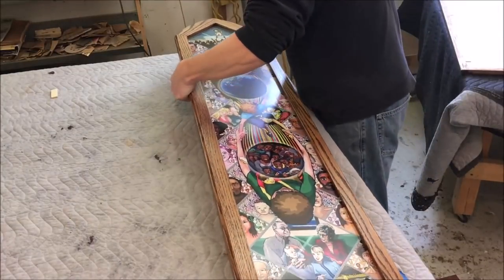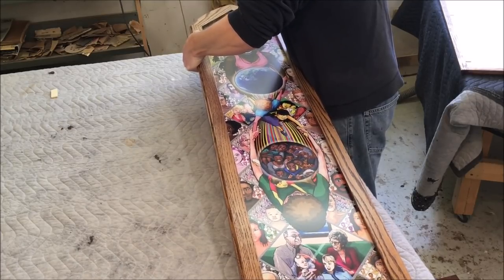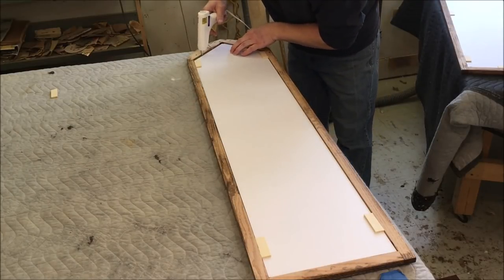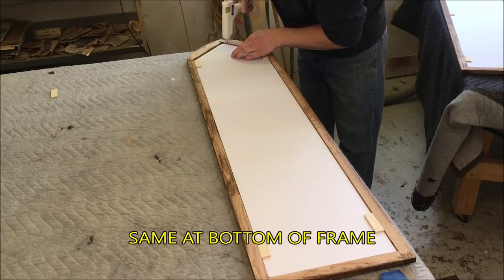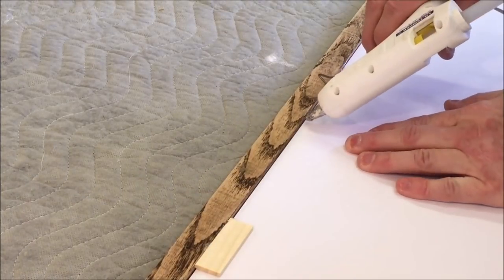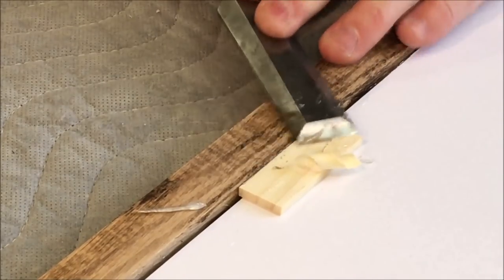Now I'm going to flip it over and make sure it's looking straight. I can slide it a little bit underneath those blocks - that looks good right there. Then I'm going to take a little bit of glue and squirt a little in the crack, making a little bumper. Once that sets up it will hold the artwork in place. After all the blocks are in place, I go around putting a few little beads along the entire length. Once the glue hardens I take a chisel and shave off the excess glue, and shave the pine block down flush with the frame.